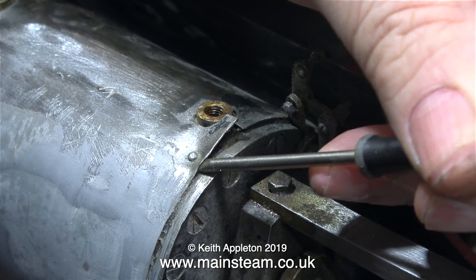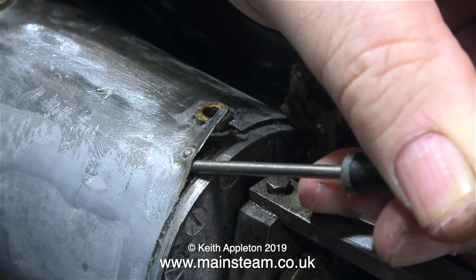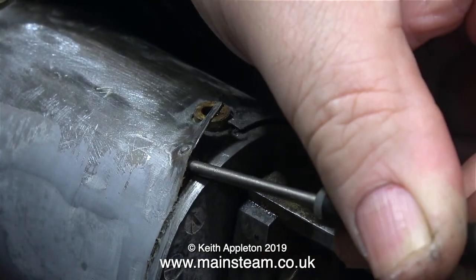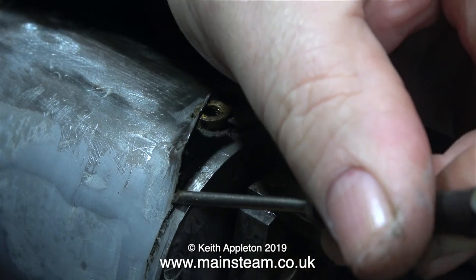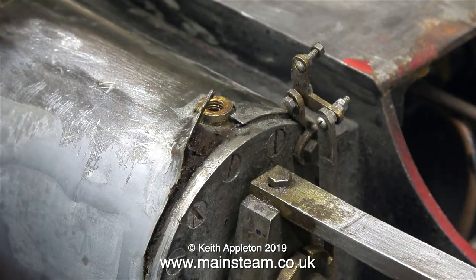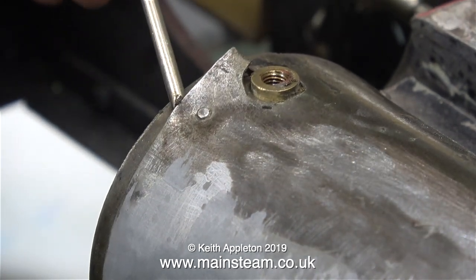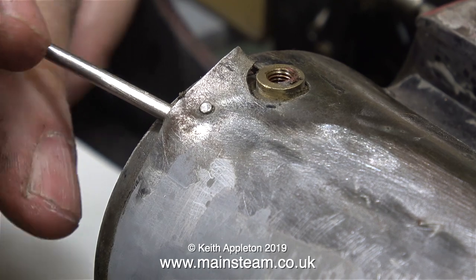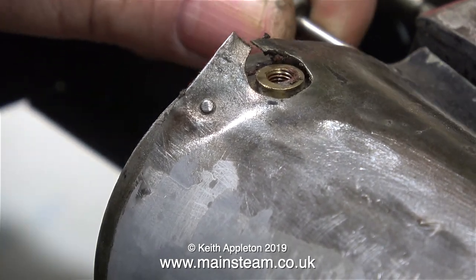With a very small screwdriver and a very small hammer, it's time for some controlled ultraviolence. This cylinder cladding is very thin, and it's held to the main cylinder by some small rivets. I'm levering the cladding away around the rivets, which will hopefully pull all the rivets out of the cylinder without leaving them behind. I like everything to be serviceable, so when I refit the cylinder cladding — which will be thicker — I'm going to attach it using small bolts. I'm tapping the screwdriver underneath the cladding very close to the rivet, and you can see how the cladding pulls the rivet out of the hole. If I hit the rivet with the screwdriver, it will probably break and half of it will be left in the hole, then it will need drilling out, so I'm trying not to do that.